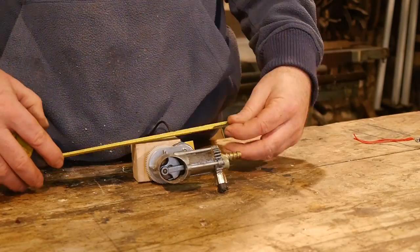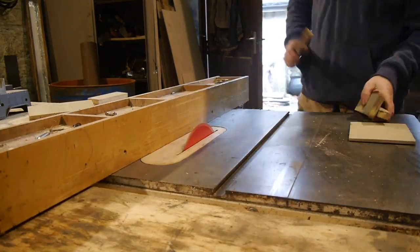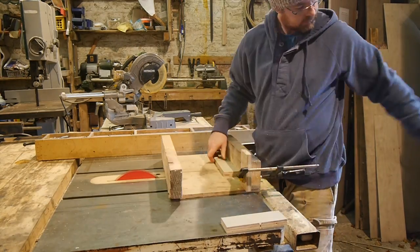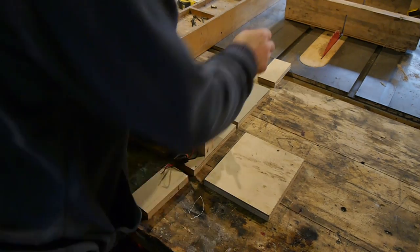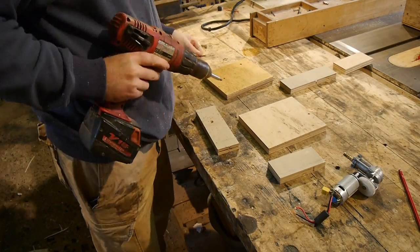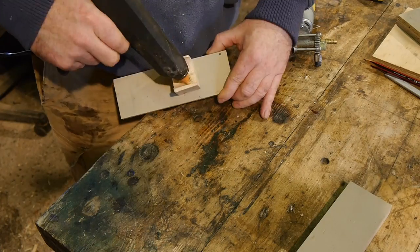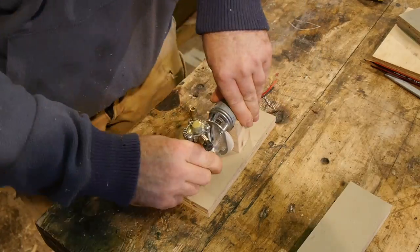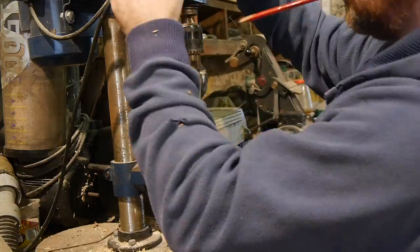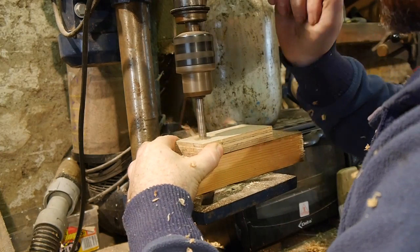To house this we're working with some three-quarter inch plywood cut-offs — it's just what I have on hand. The box itself I'm just going to butt joint together with some glue and nails. The hose has a little grommet on it where it entered the plastic box of the jumpstart. I'm going to utilise that — I take some measurements, drill my hole with a Forstner bit, then countersink it to the right thickness so the grommet will stay in place.